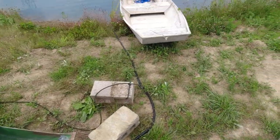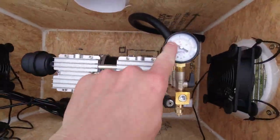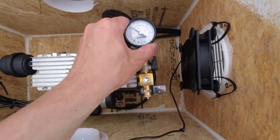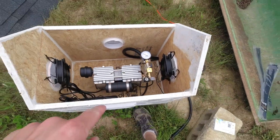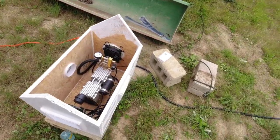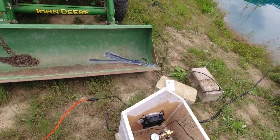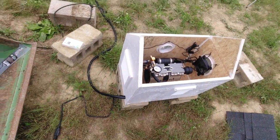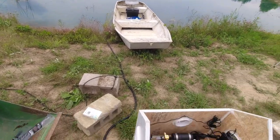Another reason you need a rocking piston — we're at 10 PSI right there. That's a pretty good back pressure, and a diaphragm pump probably wouldn't get that done. When I go to bury the line from here up to the house, one thing to keep in mind: you can't use the 5/8-inch line the whole way — it builds up way too much pressure. You've got to use an inch or inch-and-a-quarter line. I've got some water line up in the barn I'll use to minimize back pressure and not overwork the pump.